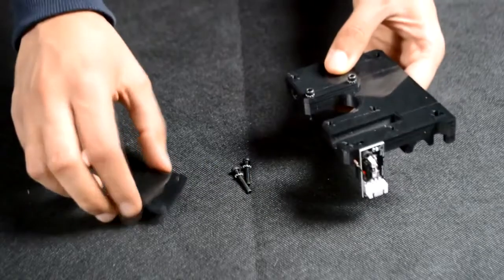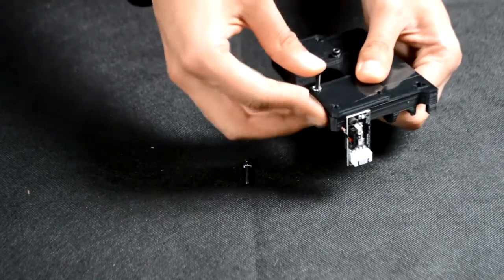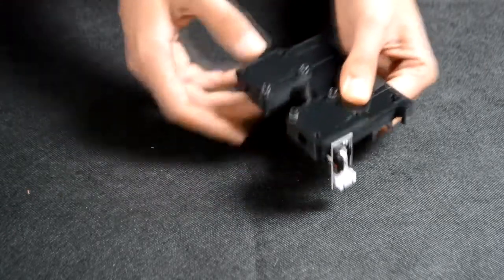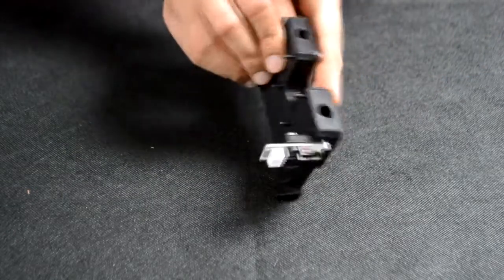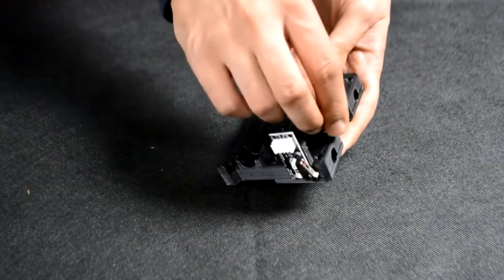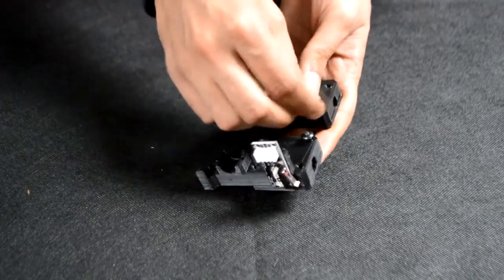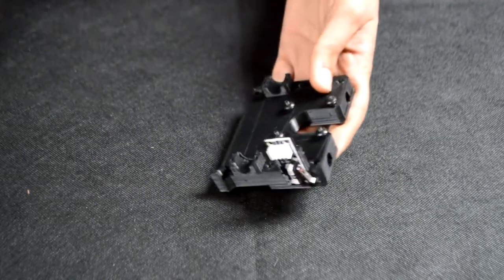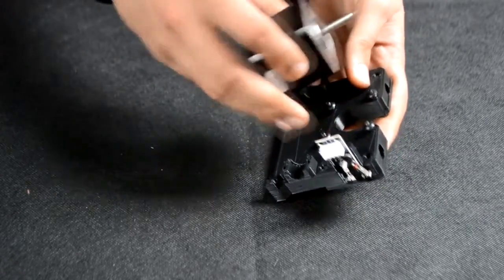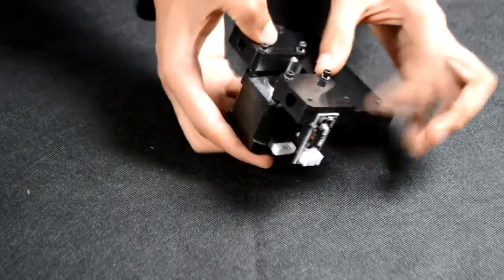and slide two of the bolts onto each of the clamps, like so. Next, flip it over, take four M3 rubber dampers and slide them onto the bolts. Next, take a NEMA 17 motor and with the clip facing the end stop, attach it onto the bolts like so.